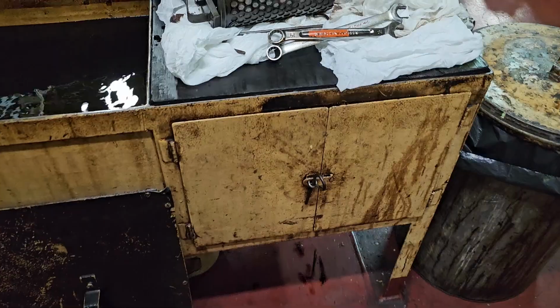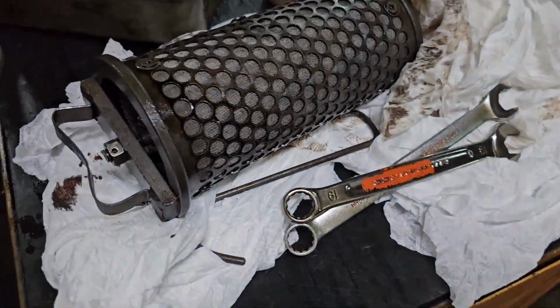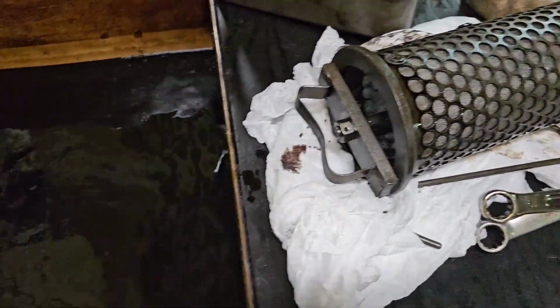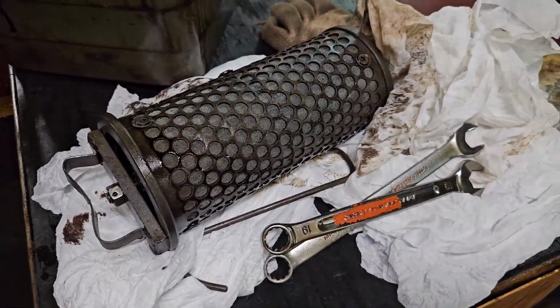So in the purifier room here, got a couple purifier strainers. Want to pull out, and do that all the time. Make sure that they're clean, operating correctly, and then I'm going to get those all cleaned up and then reinstall them back in. So I'm going to knock that out real quick here. Here you go. So just disassemble all this, clean it out, and then reinstall it.